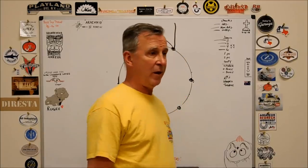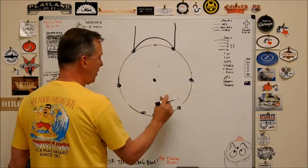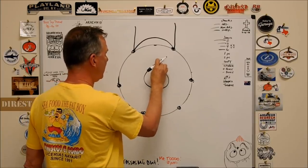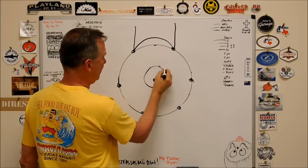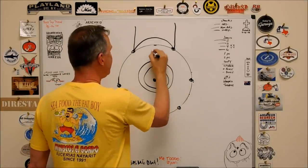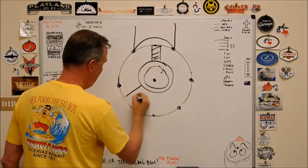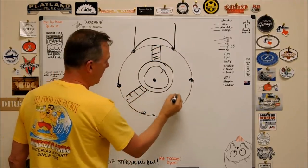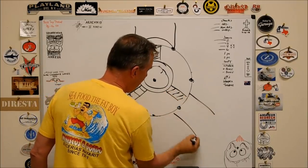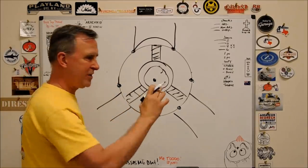It may, but when I bore jaws, I bore with a spider in the jaw. Here's your piece of pipe and a piece of tape. That's ugly, isn't it? There's your piece of pipe. You got your set screws in your jaws. Going to bore your jaws. The part just slips in.